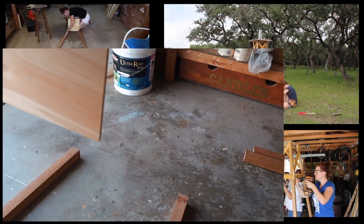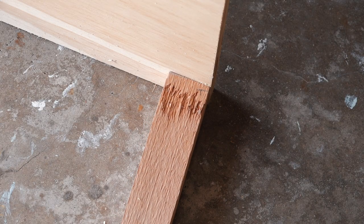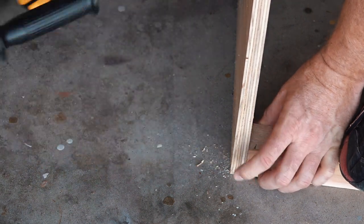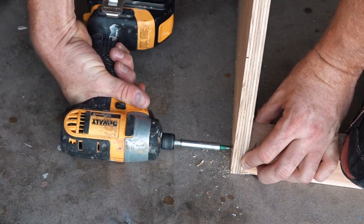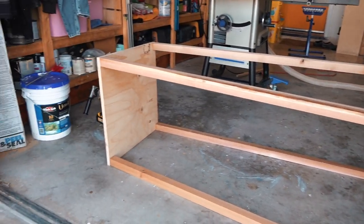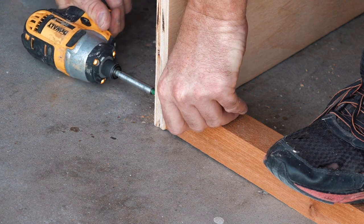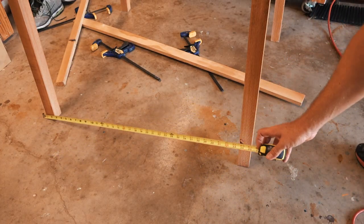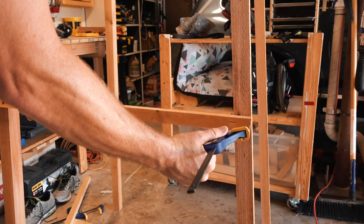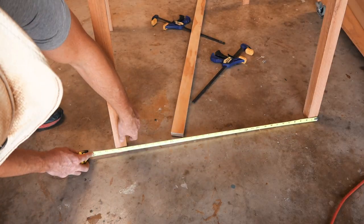The whole design and building it with this temporary top plate is based on a video April Wilkerson did, and I've linked to her video down below. With the top plate in place I can stand the whole thing up and then work in the upright position, which also makes it much nicer to film. To fit onto the foundation the legs need to be 34 inches apart, and luckily they are. I'm holding everything in place with some temporary braces before screwing in the actual braces.